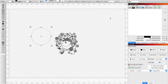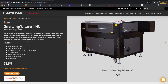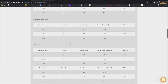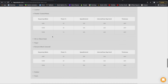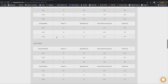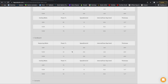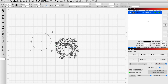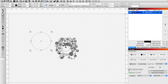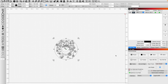The most daunting part was figuring out what settings to run for different materials. If you go to Laguna's website they have a settings chart — it's in a weird spot but they also have a simplified version in the manual. I don't see cork listed, so I'll reference cardboard — cardboard is 20 power at 350 speed. So I'll set speed to 350, power to 25%, and set it to fill. My cork is 7 inches, so I'll go load this in the machine. Turn on the key to fire it up, let it run through its homing cycle, and then place the piece in there. I set my origin, used the frame feature to trace the outline of the shape for alignment, then deleted the circle once it was aligned.